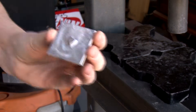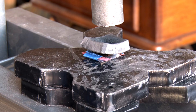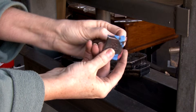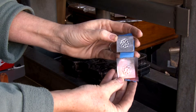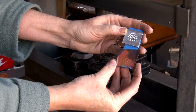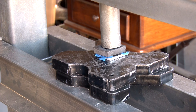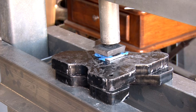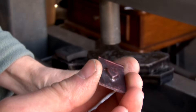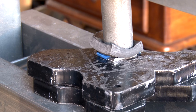Here we go — I'm going to try pressing that one. I wish I had a gauge on there telling me how much pressure I'm putting on stuff. That one looks pretty good — it pressed in there really well, actually did a lot better than I thought. Here's another one: it helps to have a piece of rubber on there to actually form the metal into the die. The copper has been annealed, so it actually forms over the die really well.